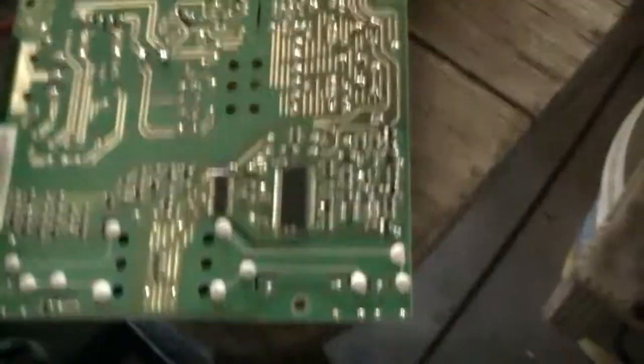But it did ooze a little bit of its guts out. So it's not a super critical circuit. If I put a 470 microfarad in place of a 1000 microfarad, it's not really going to make much of a difference. So let's put this monitor back together and give it a test. Power on. That's better. No signal, it should say. The light stays on.